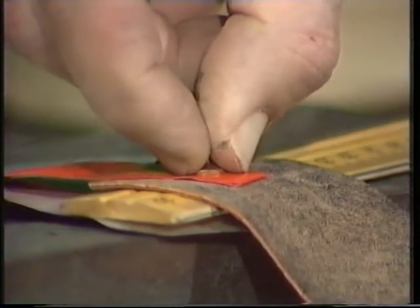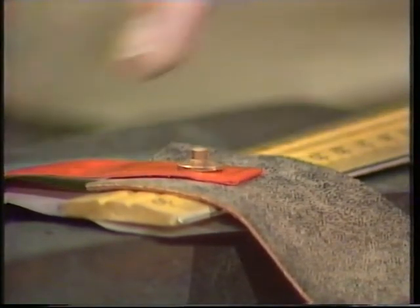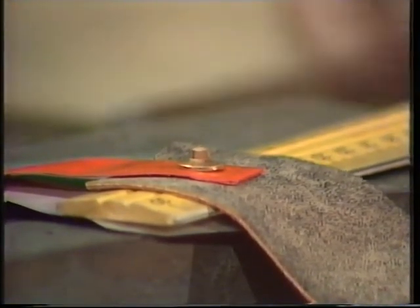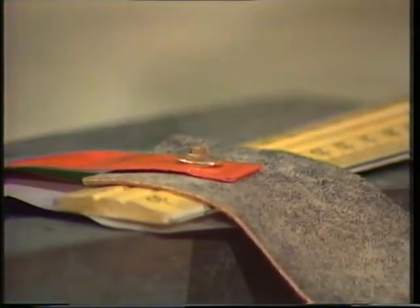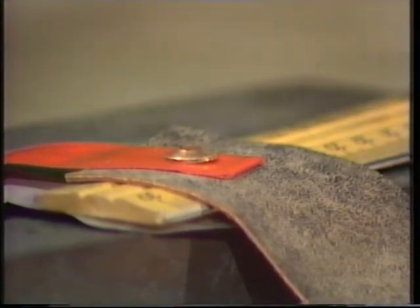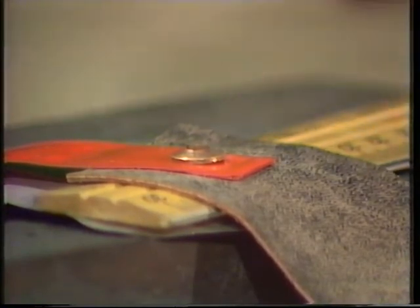At about that stage, we take the washer and shove it on. When you finish it, the rivet should poke out about that distance. If it's too long, it'll bend over. If it's like that, you can crimp it with a hammer and it'll clamp down on the washer. Use gentle blows to begin with — that'll stop it going sideways — but as it crimps down on the washer, you can get a bit harder.